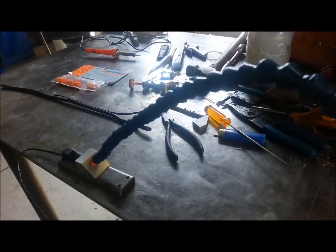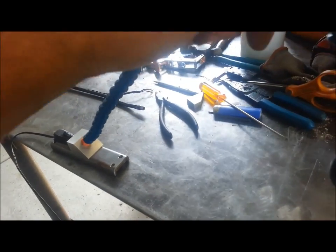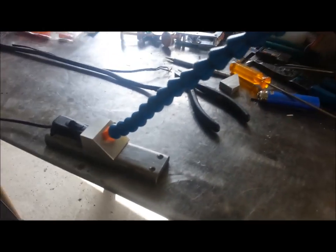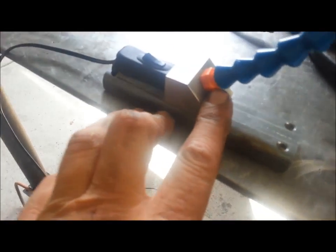Okay, here's the last little bit. I'm getting some glare through that door, sorry. Lights all put back together, and it works. It is DC, so watch your positive and negative. Mind your positive and negative if you're going to solder connections. Little aluminum block, tap for 1/8 inch pipe. I cut out a cavity here in the back so the switch would drop in, down on double stick tape, tie wrap on the rear wire.